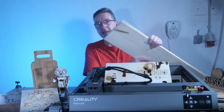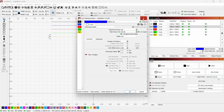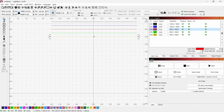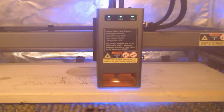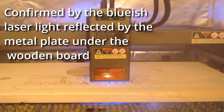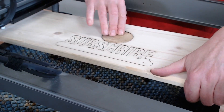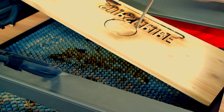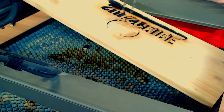That's not a reason to give up. I found an even thicker board at 17.5mm in my workshop and started doing test cuts, starting at 120mm/min at 100% power and going down to 40mm/min. The sweet spot seemed to be around 50–60mm per minute without the material catching fire. So I gave it a second go — and it really did cut through 17.5mm wood in one pass. The cut went through but not at all places, so maybe 50mm/min instead of 55mm/min would have been better. There was also a crack in the board, so some letters broke off and had to be glued, but all in all it looks nice.